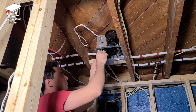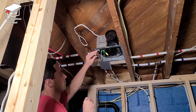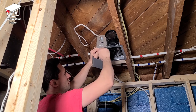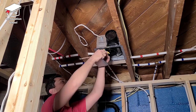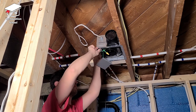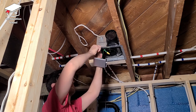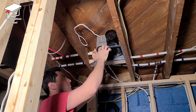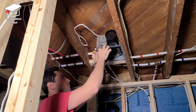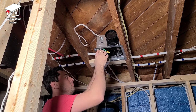After the ground wire is connected, connect the white wires together, then connect the black wires together. It's very important to use good quality wire nuts — it is going to be a fire hazard if they come loose in the future. Make sure to give them a pull test to ensure they're connected properly. I always like to use electrical tape and tape up the wire nuts to the actual wires to ensure they won't move, and also because it's located in a bathroom, to keep moisture away from the wire connections.